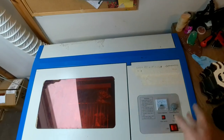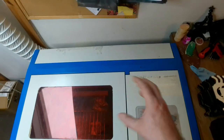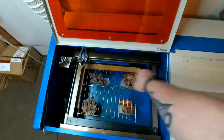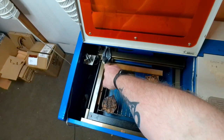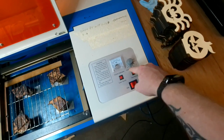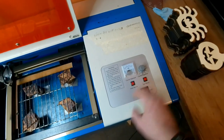I haven't done a ton of upgrades — I haven't added a digital sensor and I haven't upgraded the control board. All I've done is added some masking tape here so I can put notes down for the different settings I use with my machine. I have a mark for how far from the initialisation position I need to come down to the work piece — I move two millimetres right and down from initialisation and that's perfect. My pot has little pencil markings from testing which material cuts and engraves at which power and speed, and I have notes on my PC for all different types of materials.